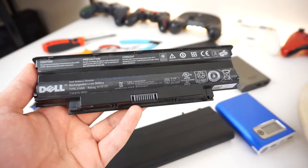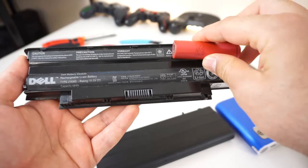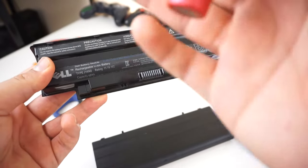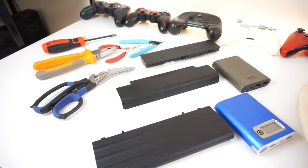Well, there are actually a bunch of cells in here, just like this one here. This is a six-cell battery, so you have six batteries inside. Usually a section of the cells dies out, and even though the battery doesn't charge, you will still have some good cells somewhere in here. We're showing you how to take them apart and how to check for dead cells and good cells.